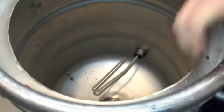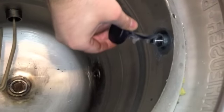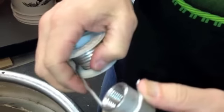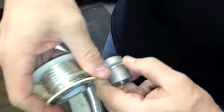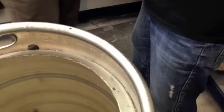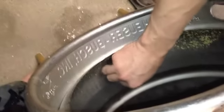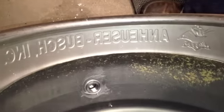But we'll go the extra step — we'll put a bead of that silver solder and we'll be good. What we like to do is flux the inside as well, and then we're going to take and make a quick ring out of this solder. You want just a little overlap there so you don't have any gaps — just a little nip.